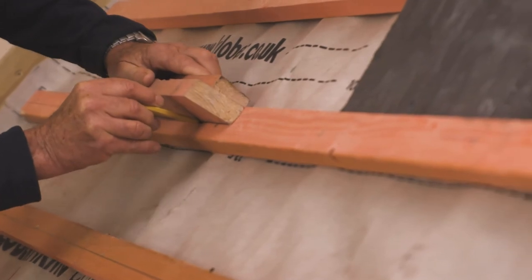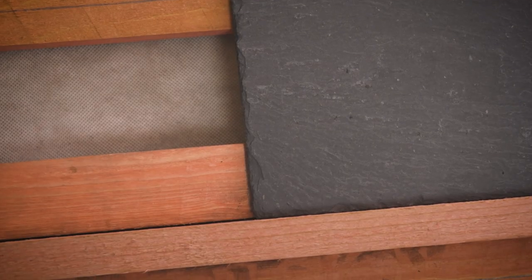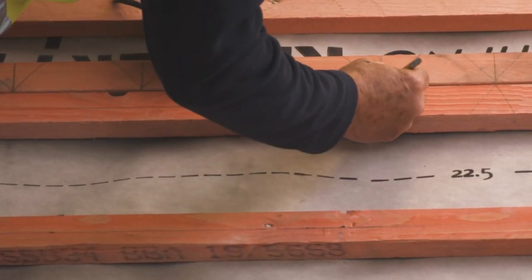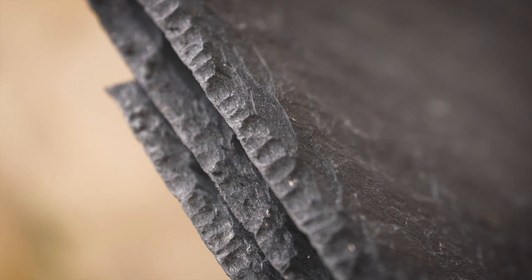So we've now finished video two. In that one, I've shown you how to mark the centre of your battens for the top of your slate, how to put the perp ends onto the roof to keep your slates in line going up the roof, grading the slates into thick, medium and thin, and measuring, marking, cutting and holing the eave. Counting up how many eaves you need and producing the number required. You're now ready to go into the next section, which is when we will start to lay the eaves and to lay the slates. Thank you for watching — hope you've enjoyed it and I hope you take a lot away from it.